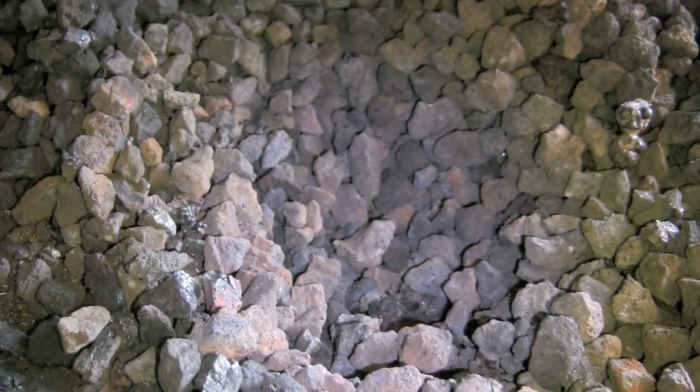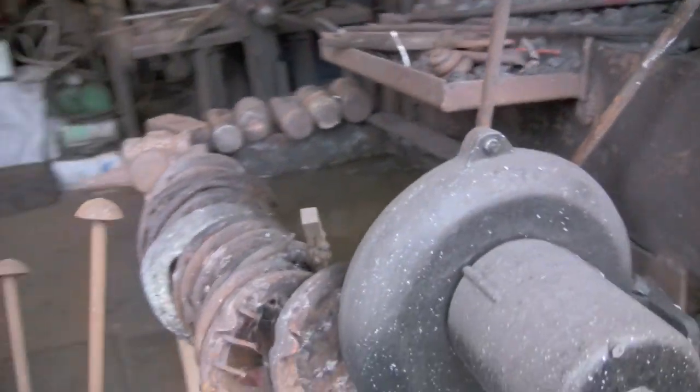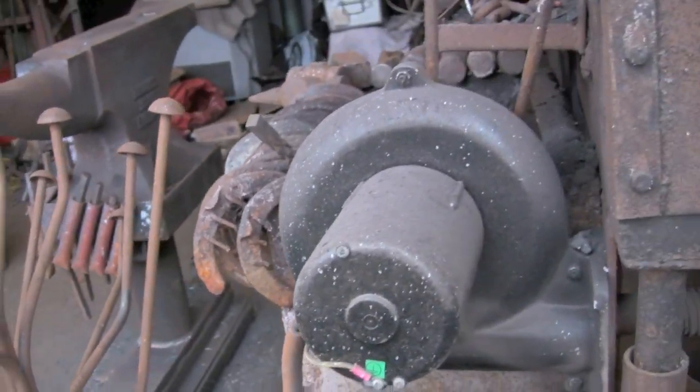In the gap in the middle that I've left, there's a bit of stainless steel about eight inches round, two inches thick, with about an inch and a half hole in the middle. You're not going to see it — I can't get to it, it keeps falling down — but trust me it's in there. It doesn't have to be stainless; it could be cast, or even heavy mild steel, but it needs to be pretty hefty because that's where the bulk of the heat is going to be, and it will burn anything else out.